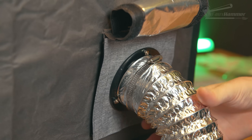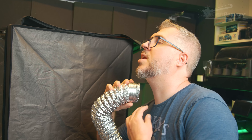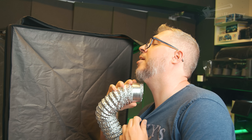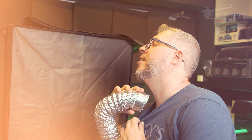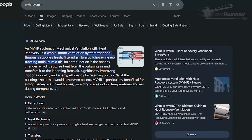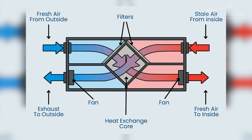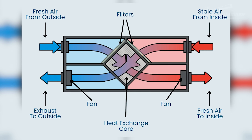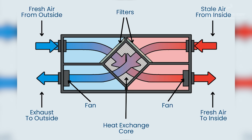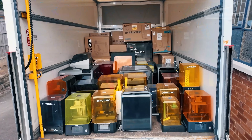This sort of thing should help at least until some brands start giving us serious options to handle this properly. As for me, I already have a basic ventilation system in my workshop, but as I'm now dealing with more hazardous products like laser engravers, I'm going to be upgrading the whole room with something called an MVHR system along with air conditioning, which will allow me to replace all of the air in my room three times an hour with fresh air from outside whilst retaining heat.